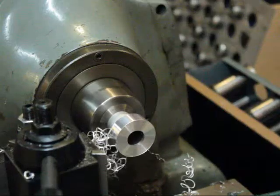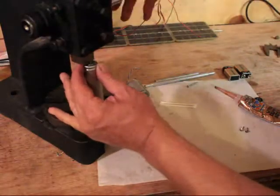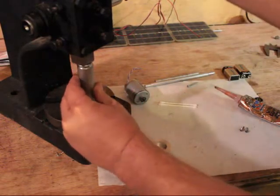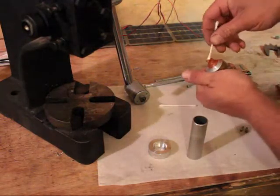The main challenge was that the oven got up to at least 300 degrees, so I didn't want to put any plastic in there. I wanted the motor to sit outside of the box, kind of like a normal convection oven — a commercial one, albeit in miniature. So I used all aluminum.